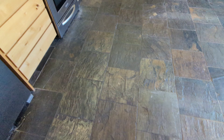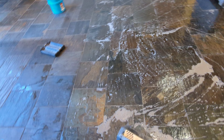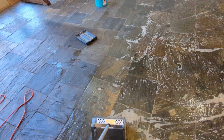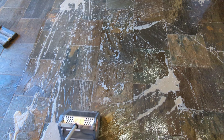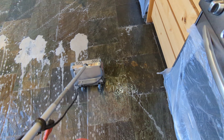I'm going to go all out — there's no reason to start tame on this one. I'm thinking a Sager Tsunami and a CRB deck brush, grout brush around the edges, and then I'll see if my hard surface glide will work on this. It's pretty lumpy — it may be better with the longer bristles of a Westpac hard surface one, which I also brought. The thing with slate: you don't want to use a spinner. It takes 700 PSI to get a spinner to move, and 700 PSI will often pressure-etch circles into a soft stone like this — and that can be virtually irreparable. Do not use a spinner on slate.